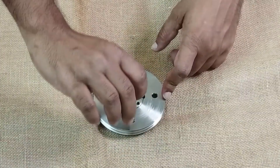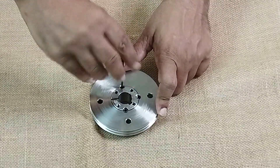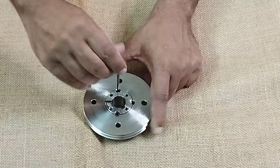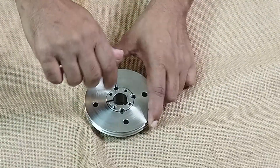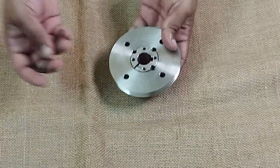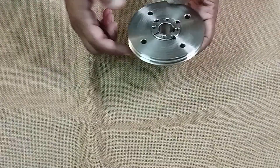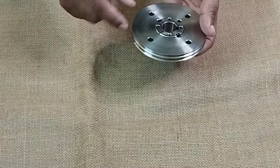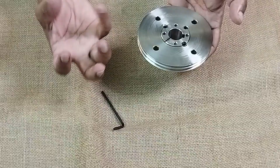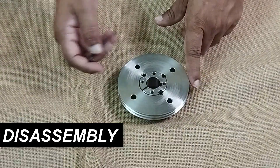You can see here — if we tighten it, that's how it is locked into the rotating device. Now it is fixed. I'm not tightening it too much, otherwise it will be difficult to pull out. In practice, on any rotating device we have to tighten it slightly more so that it doesn't loosen up. Because of the slot, the bush comes closer and grips the shaft.